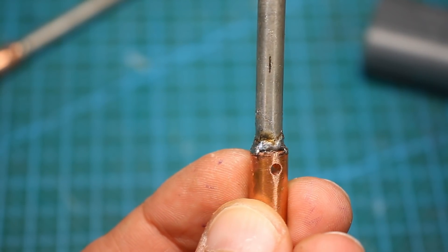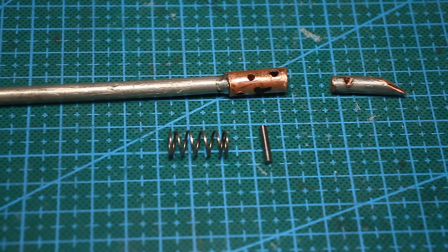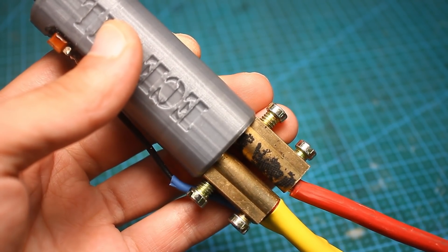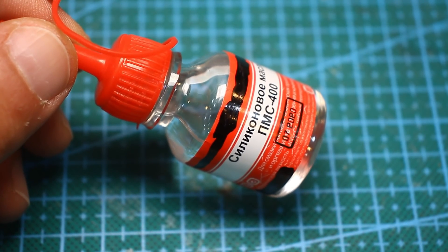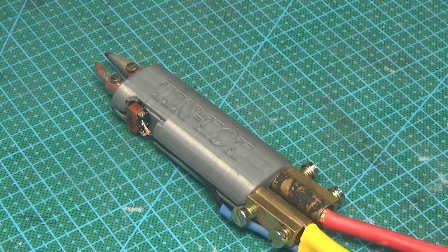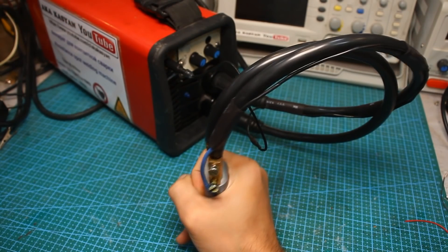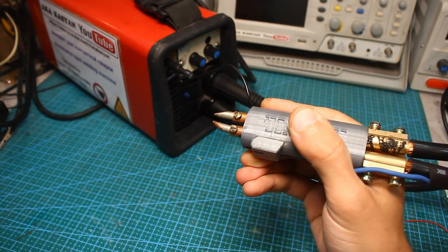The electrode assembly consists of two copper rods with a diameter of 5.6 mm, a pair of pressure springs, copper sleeves, a micro switch, and two locking guide rollers. Copper sleeves with a pair of through holes are soldered to the rods on one side — the first hole has a thread for fixing the electrode, and the second without a thread is for the locking roller. At the other end of the rods, electrical brass terminals are fitted, into which power wires are inserted and secured with a screw. The moving parts are lubricated with silicone grease. I used copper stranded power wires with a cross-section of 20 square mm. It is important to choose the right length — too short will be inconvenient, while long wires will have large losses. In my case the optimal length of each wire was about 45 cm.